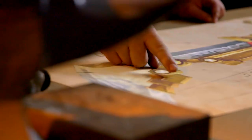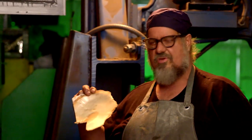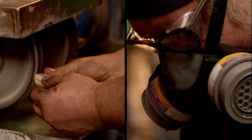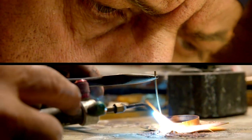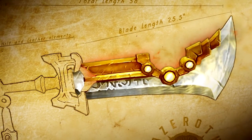I could see these white glowing gemstones surrounding elements of the Ashbringer, and I thought mother of pearl would be a phenomenal-looking material. I'm going to cut cabochon stones out of the mother of pearl with a 6-inch diamond saw. However, mother of pearl is very toxic — the dust is actually poisonous and lodges in your lungs. I'm going to use a full respirator and water so that dust doesn't get into the air, so I live a little bit longer. Then I'll make sockets — little bezels, little strips of brass — that the mother of pearl goes into. This is number one of ten, and they will be set into the spine, pommel, and the dangle on Ashbringer.